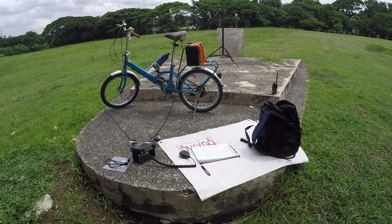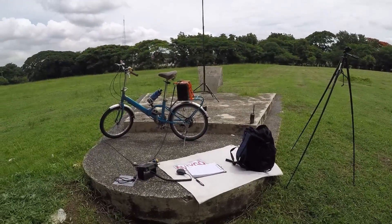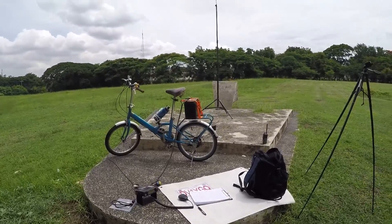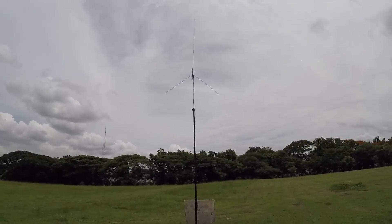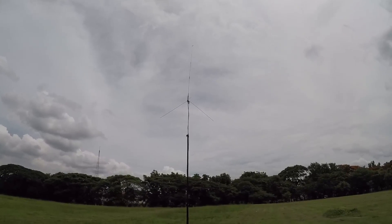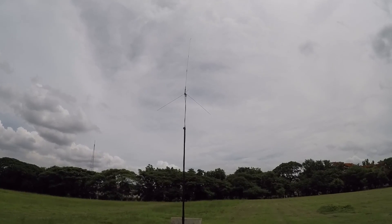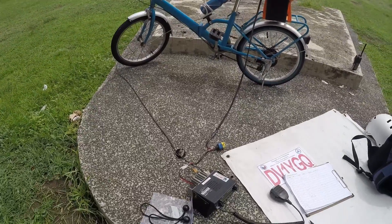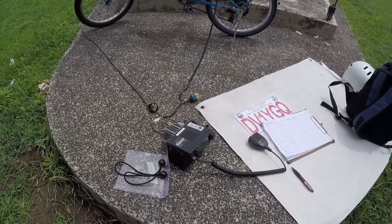So I'll just show you the teardown — the drill is already over and I'm going to pack up soon. This is my entire field station. There's my tripod on the right. I'm using an ICOM IC-2300H connected to a mobile antenna, a Diamond SG2000, with some DIY ground radials for better propagation and better SWR. I used an 8-meter long RG58 for the feed line, and earlier I connected an SWR meter between the feed line and the radio just to make sure everything was okay.